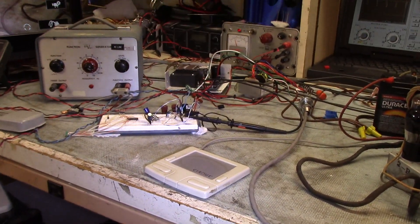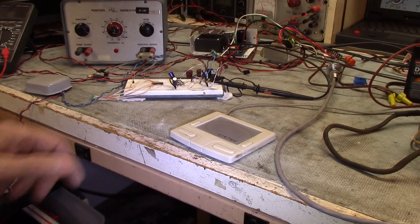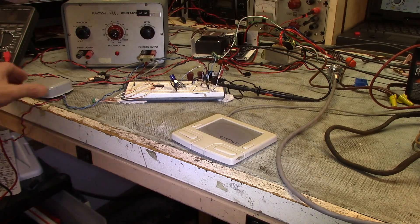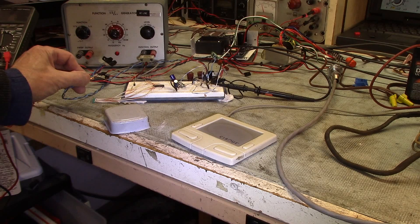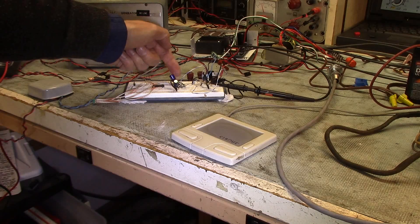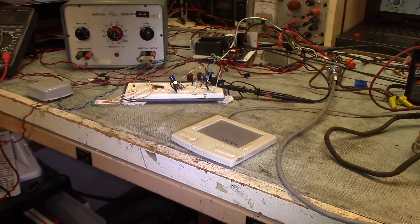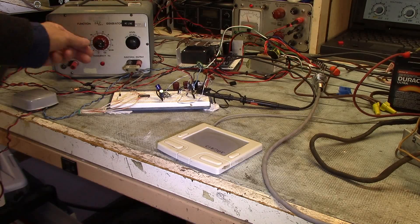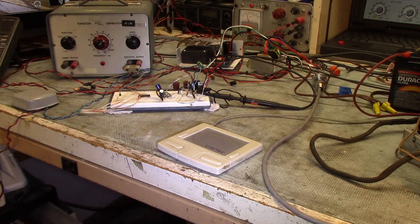Some of the little issues I had: I had an opto-isolator I'd gotten out of an old Radio Shack package — no returns — and it seemed to act flakey and just stopped working. I eventually gave up and used a slot opto as power isolation, because I don't want 600 volts in anything else. I might later package this all up with a 555 — I did play around with the 555 there. But at the moment I'm just using a function generator, which I haven't used in years — it's nice to see it still runs. Unfortunately the fine control on this guy isn't working, so I can only get coarse speeds. It looks like 100 hertz seems to be working well.